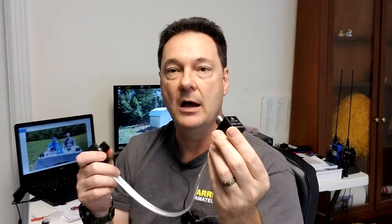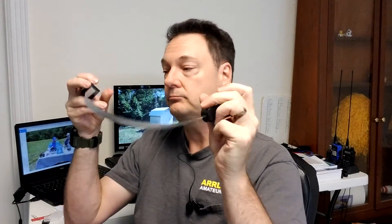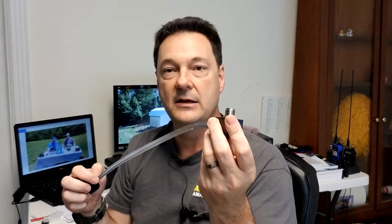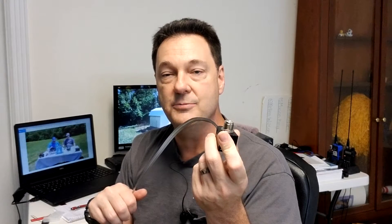What you do is put one of these outside — ideally you'd mount it on a piece of wood to keep it up off the ground. Then you plug your coax from your antenna into here. Then you slide this under the door, or in an actual window you would mount these two parts on either side of the window. This ribbon cable goes in through the door sill or window sill, and you close it on top of the ribbon cable. Now you've got the other end on the inside, where you can run the jumper from here to a splitter or directly to your radio. Let's go ahead and put that in, and I'll pan the camera to show the connectivity option, and then we'll give it a test on the radio.